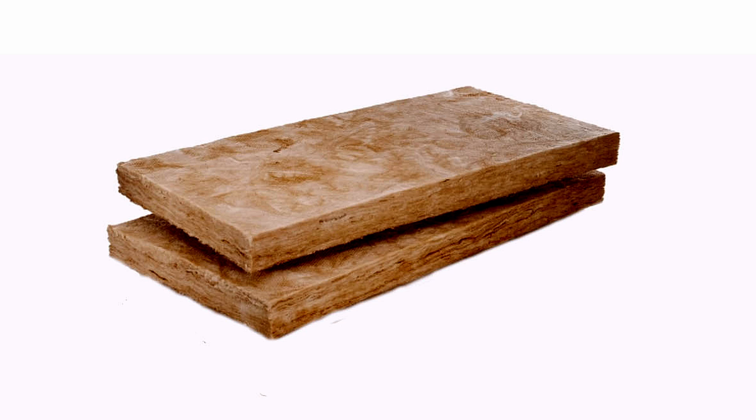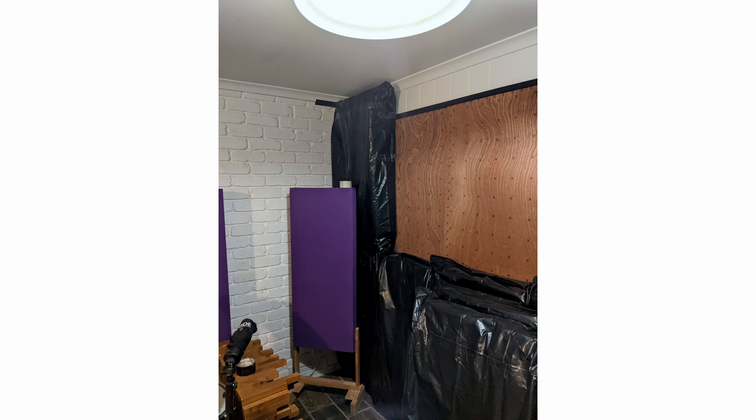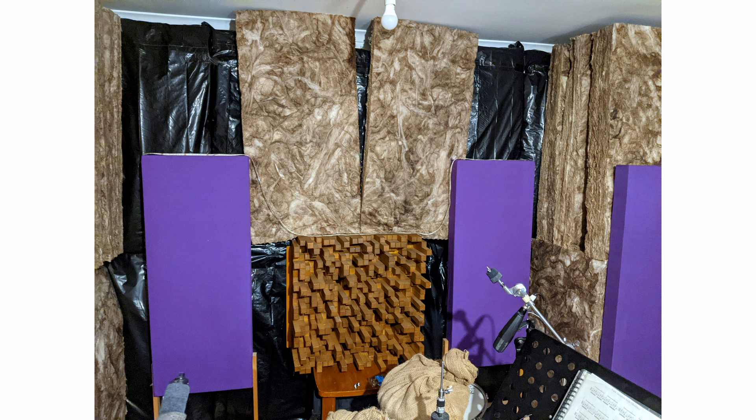To construct a single panel, I placed two bats on top of one another, then carefully slid a garbage bag over the top and then one over the bottom, being careful not to deform the bats. You then seal off the bags with the clear tape to ensure that the inside remains airtight. Should you tear any holes in the bags during handling or installation, either replace them or patch them over with some of the clear tape. Place these bags on all walls, being sure to add a non-reflective bat layer in front. I used the exact same insulation used inside the actual limp bags themselves. After that, put a breathable fabric over the top to finish them off and you're good to go.